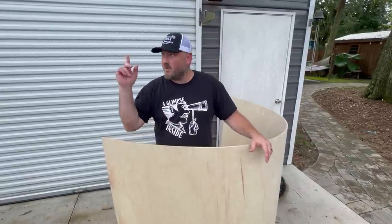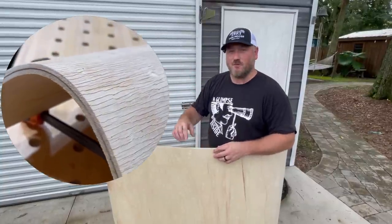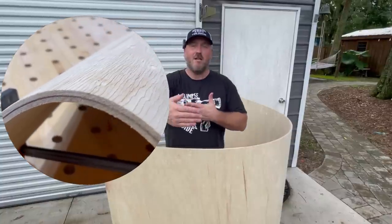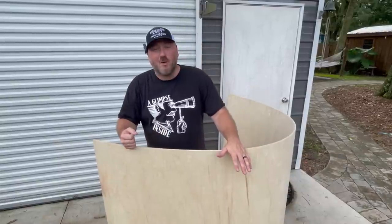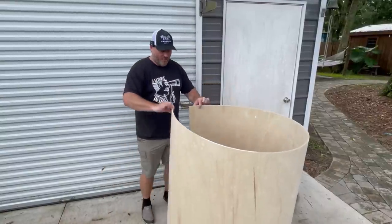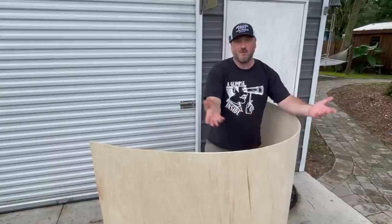It's constructed — and I'll show you a close-up right here — of a thin veneer of ply in the middle running lengthwise, and two other pieces that sandwich that veneer with the grain running the opposite direction, which makes it very flexible. You can also get this to flex the other way. Basically the four-foot ends are touching here; you can buy it the other way around where the eight-foot ends would bend and touch each other.